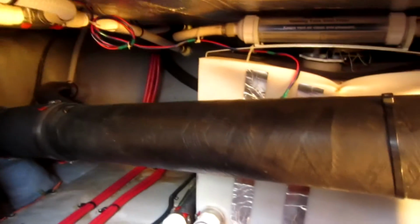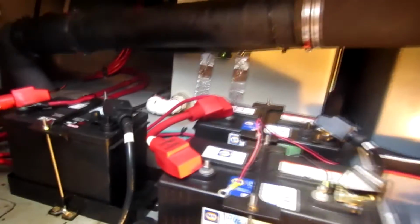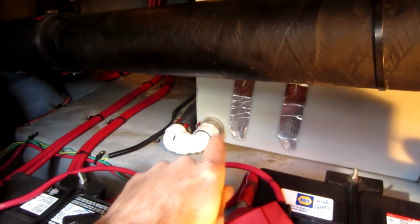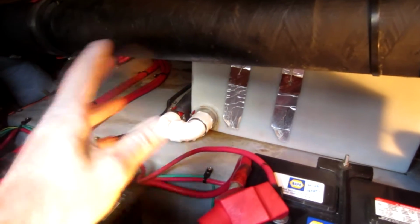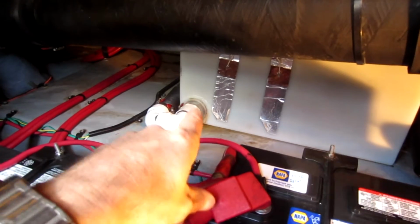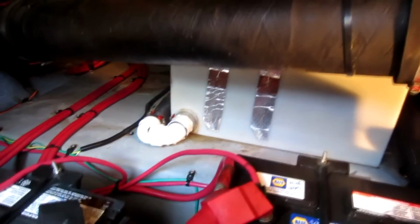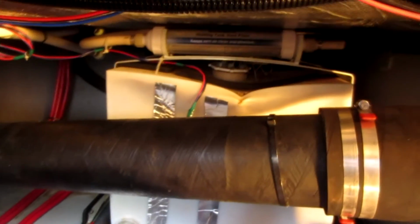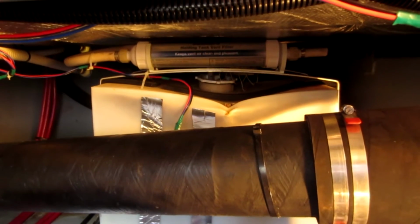These two pieces of the exhaust system, after the batteries, come out before I can get at the holding tank. And the issue is it's leaking right there. That fitting has become loose. I'm sure it's a result of all the pump outs and pressure and whatnot. Yeah, that fitting has come loose and it's starting to leak. And beyond that, the tank itself is, like Anchor Girl just said, imploded. It's got oil canned. But I'll get to that in a minute.